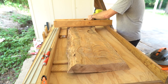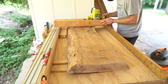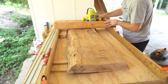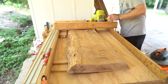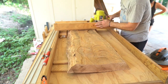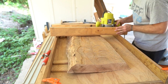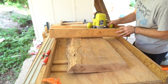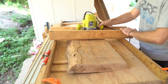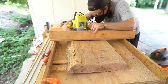This took several days — it's a lot of work. The reason why it's so difficult is because I cut this from a big branch with a chainsaw, and you can see where some of the indentions from the chainsaw are. So it's not a perfectly straight slab. If I had some sort of wood planing machinery, which we don't, that would help — but I'm going to have to work really hard to get this thing leveled and planed out with my router.